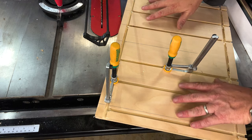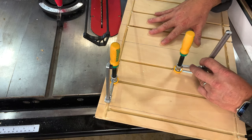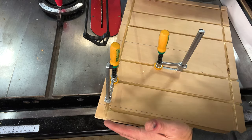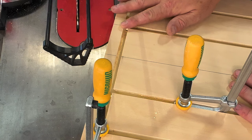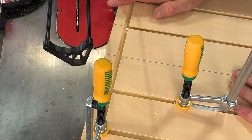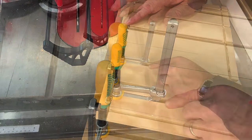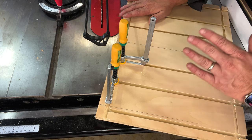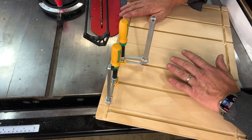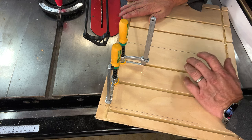Here's a closer look at the cuts we just made onto our jig. As you can see, the clamps fit very nicely into those grooves and go down the length as well as the width of the board. You'll notice I didn't make a through cut on the edge that's going to be facing the blade — I wanted to have a stop so that the metal on the clamp will never touch the blade, and that's something I highly encourage you to think about. Now the only thing left is to test it by making a tapering cut and a jointing cut.